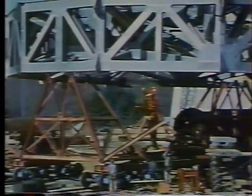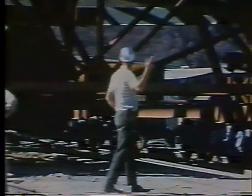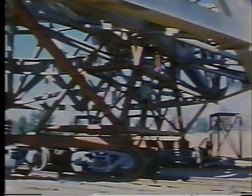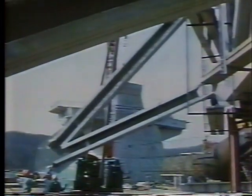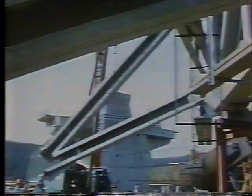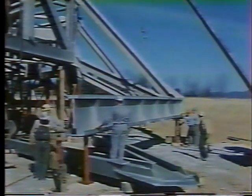Two steel A-frames mounted on railway trucks to form a single carriage were rolled underneath it. The structure was lowered until the declination bearings were secured to the A-frame tops. It was then towed by a truck 60 feet out of the way. In the new location, cantilevered aluminum trusses to hold the outside surface panels were tied in. The outermost stringers were fitted to the cantilevers, checked for position and elevation, and final welding began.